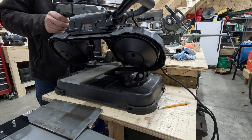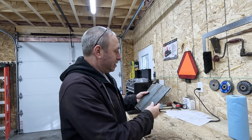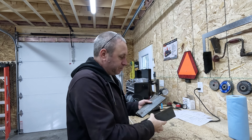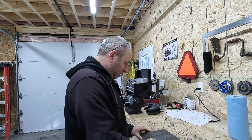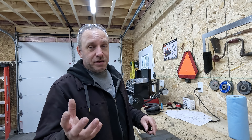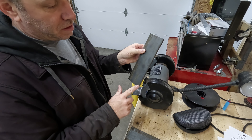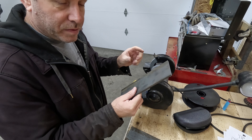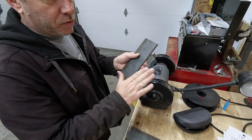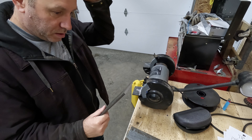I just cut three pieces nine inches long so I can butt them together and have a platform that's nine by nine. Ideally it'd be ten by ten, but this is a five-inch bandsaw so nine by nine is good enough. I don't have any plans — just a general idea of what I want to do and I'm winging it as I go, like every other project. I'm going to soften the edges and grind down the edges where I'm butting the pieces together so I have more weld surface. After that I'll grind everything flat because I need a flat surface to use as a table saw.